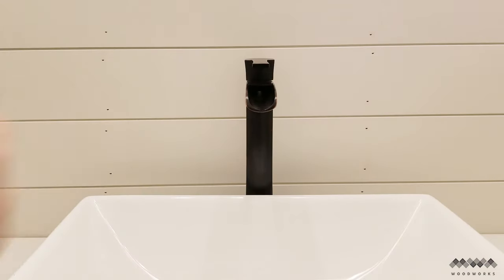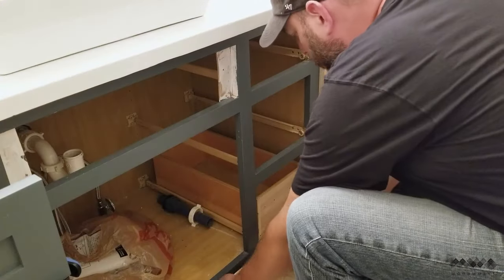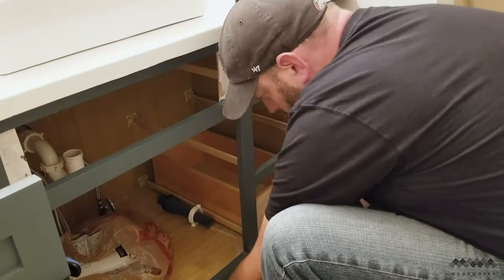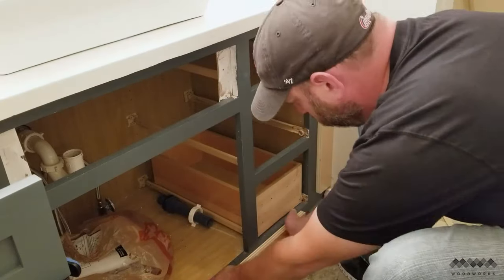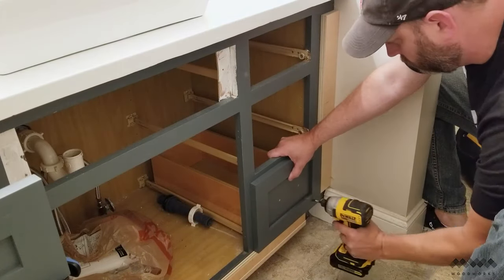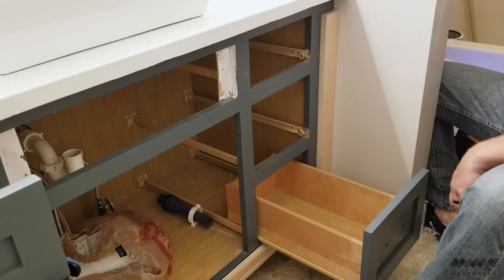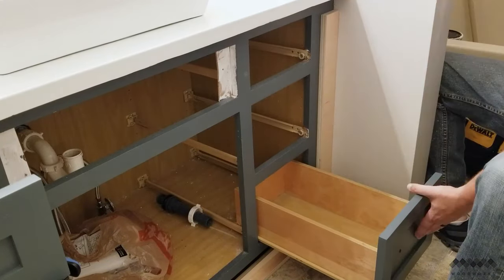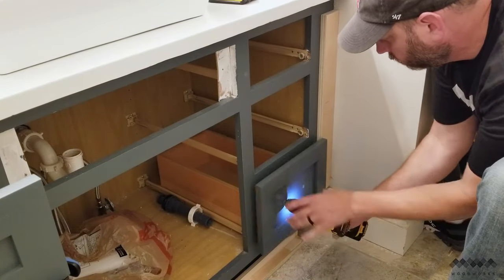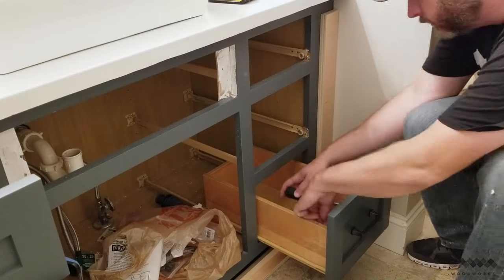I then added the faucet, adjusting it into place and tightening it down. Next come the fronts — I added guides to the bottom edge and side of the cabinets using double-sided tape to reference the positioning of each front. The way I like to install drawer fronts: I drive two screws into the holes meant for the drawer pull to hold the front in place, then open the cabinet and put the permanent screws in from the backside. I then pull those two screws out, drill all the way through the drawers, add my screws, and put the drawer pulls in place.